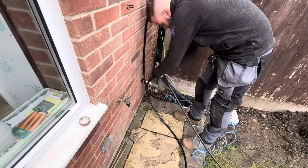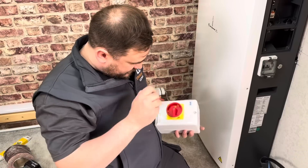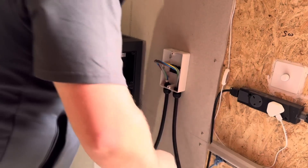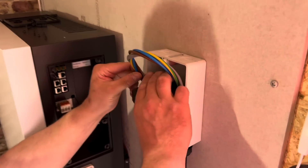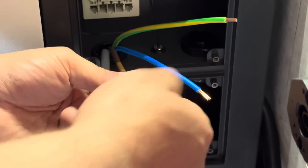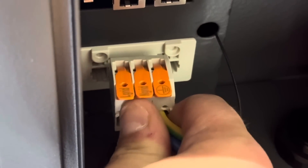The cable is pulled through the duct into the office. The all-in-one requires a 32 amp AC isolator, so we're fitting one from BG. With the EV Ultra, you can strip it back so that the Cat5 continues through without any terminations. The six mil terminations are connected into a Wago connector and plug in, and the Cat5 is then plugged into the gateway PCB port.